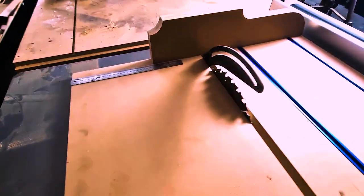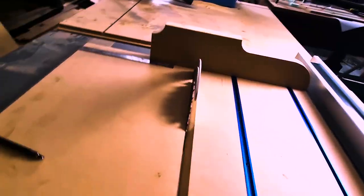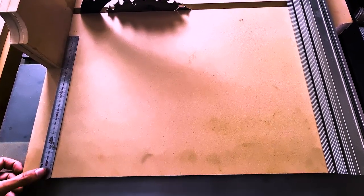Because there's a bit of weight to the design, I'm going to mark out a semicircle around this area and cut out a bit of MDF. It won't reduce weight dramatically but it adds a little aesthetic detail. Rather than making a fancy template, I'll keep my thumb on the hanging hole of the steel rule, move it across to about 180mm where the edge aligns, and pivot it around to give me that arc. Then I'll cut that section off and sand it to shape.